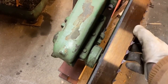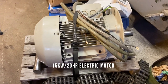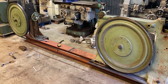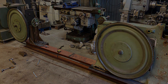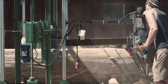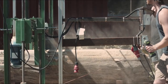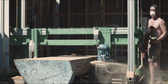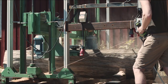All this is not rocket science, and building a small band saw mill is actually pretty easy. But as you go up in size, the curve of difficulty grows exponentially. Here is where I want to make the comparison to the chainsaw mill, which has a much more linear curve — and that is all thanks to its huge flaw that everyone likes to point out: the thick kerf. Since a chainsaw bar is so much thicker than a bandsaw blade, it is going to remain flat no matter what. And if you want to build a really big chainsaw mill, all you basically need to do is buy a very long chainsaw bar.